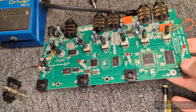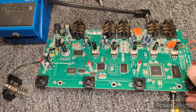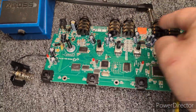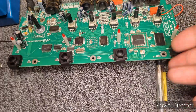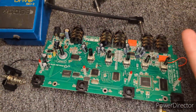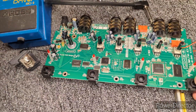Interestingly, the schematic has up to about 12 tests, but when I was testing this it only gave me 10. I tried it on the working one too and the same thing occurred. There's also a frequency test to check the inputs and outputs, but that test didn't work even on a working unit. The only thing that was wrong with this one, and I couldn't troubleshoot that — which kind of sucked — but it does test to make sure the flash memory is being read correctly, which is great, so you can rule out a problem with that chip.